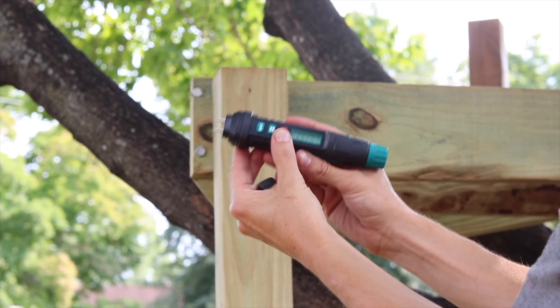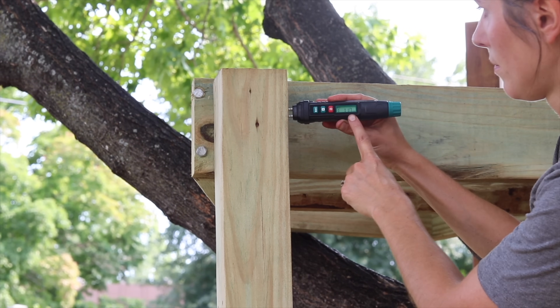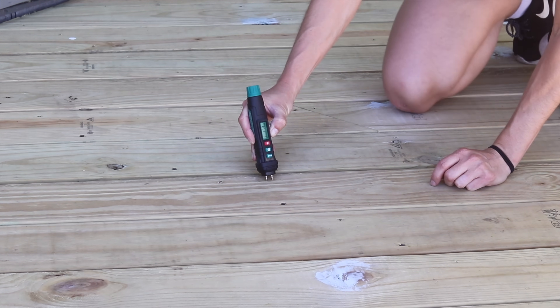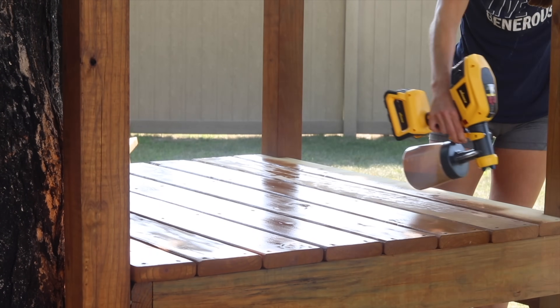Who knows if it's a month, six months, a year, seven years — you don't know. So this is a moisture meter. It actually reads how much moisture is in the lumber. You put the prongs as deep as you can and it reads the percentage. You want it to be less than 15% moisture before sealing the wood.